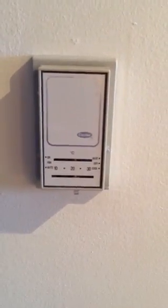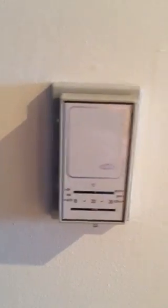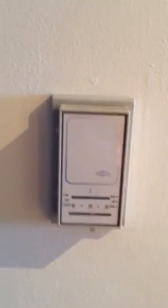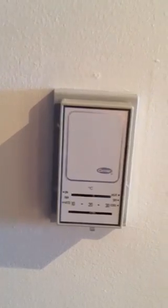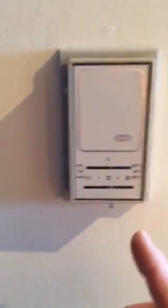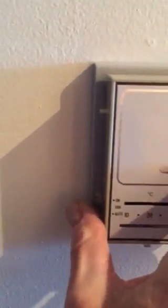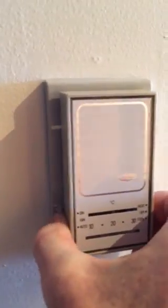So we had a leaking gas valve on our furnace. So I changed that. And after I did that, the furnace, although it seemed to be running okay, was short cycling and it would never get up to the temperature that we had set on the thermostat here. So looking inside here,